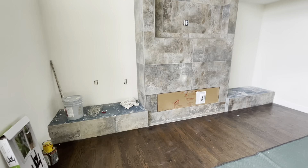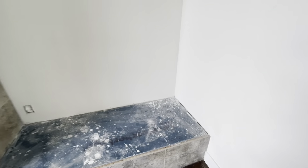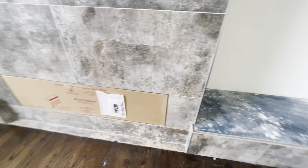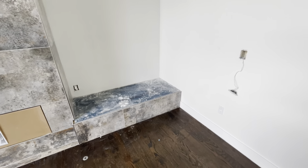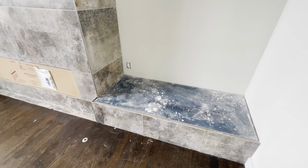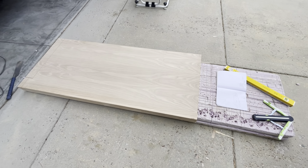Back at the job site after getting the bench tops and shelves pre-built in my shop — now it's time to scribe. I went in and measured the angle of that far right corner, then used measurements from left to right in the back and left to right in the front to the tile, and measured out how far we need to go at the angle. I had that all scribed onto the top of the lumber, and I'm going to cut that with my track saw, which will allow me to get any angle I need, then finish with a Japanese handsaw for the small finishing cuts.